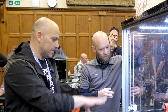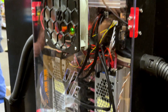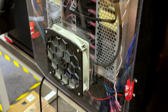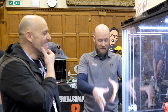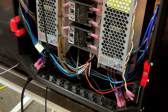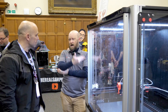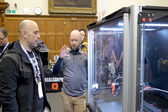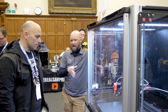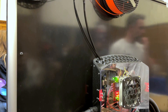The rear is as beautiful as the front. All electronics are on the back rather than underneath, because this machine is close to 300 pounds — so tipping it over to access electronics isn't going to happen. All the thermally sensitive electronics — the SSRs and power supplies — are mounted on a 6061 aluminum plate and thermally compounded to it to act as a heat sink. There are 120mm Noctua fans on the back actively cooling that plate and those components to make sure they don't overheat.